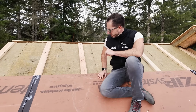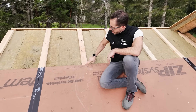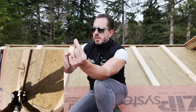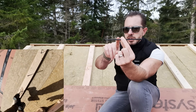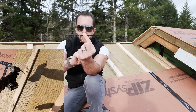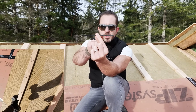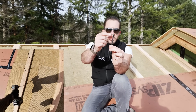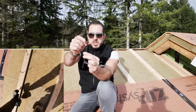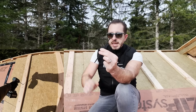So what about the venting side of things? That's where the 2x4s come into play. These are screwed down with Simpson fasteners. This is the Simpson SWD screw — it's going to go through the 2x4, through the insulation, through the sheathing, and into the top chord of the PWT I-joist rafter. It will easily drill through all of that, but the reverse threading here allows it to not over-clamp. Having a smaller head does sort of the same thing — we wanted to make sure the roof plane that the roof cladding goes on doesn't have waves to it. This allows us to control the depth of the pull.